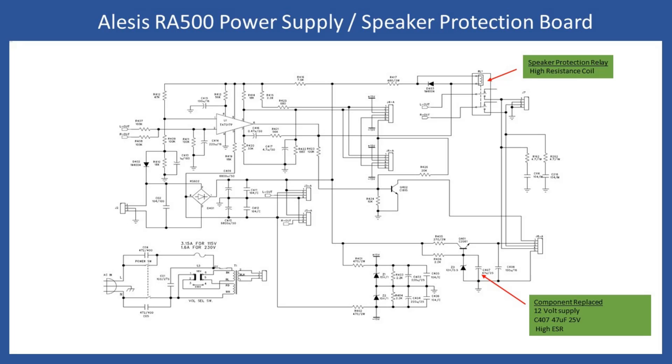What I'm showing is the circuit diagram or schematic. For this amplifier it's really the same circuit board that you have on all of the series. The only thing which is different is the bridge rectifier, which needs to be a higher current rating than the smaller amplifiers. There is a dedicated IC used for the measurement of any DC offset, which is then used to switch through for the speaker protection relay. As highlighted, the relay coil had gone high in resistance.